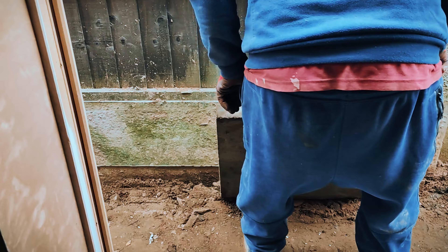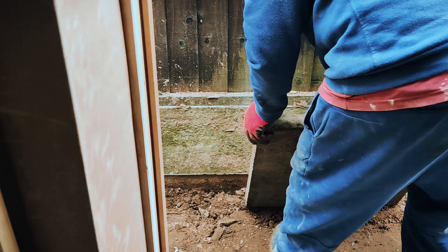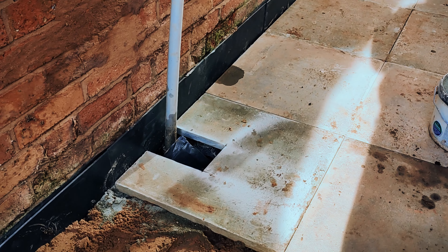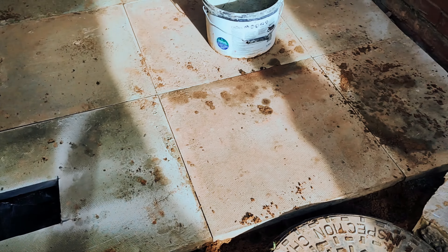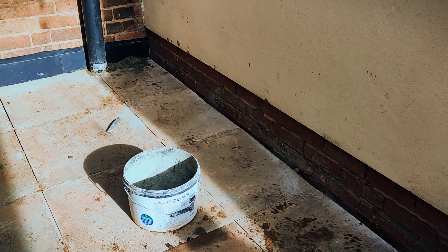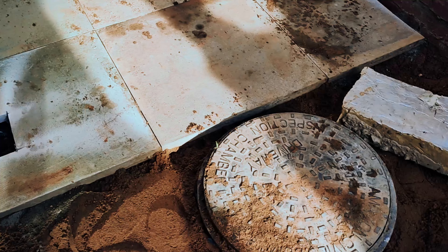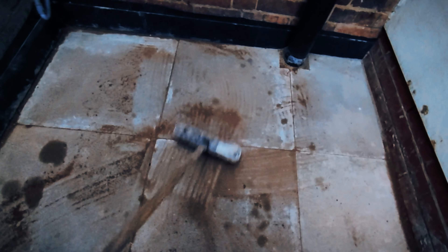You'll see a nice slate layer and the paving blocks being cleaned up and re-laid. You'll see a butt joint against that tile — that's from the extension for the neighbour, so they've already done the damp proof course, and that is above our slabs. If your slabs are covering the damp proof course, that's where your issues will be.